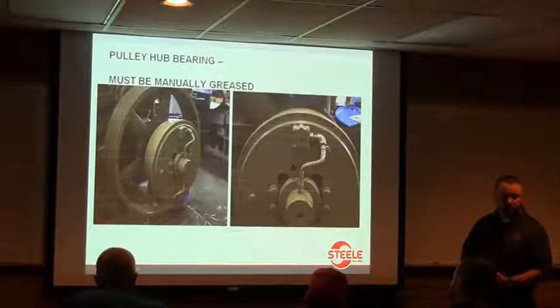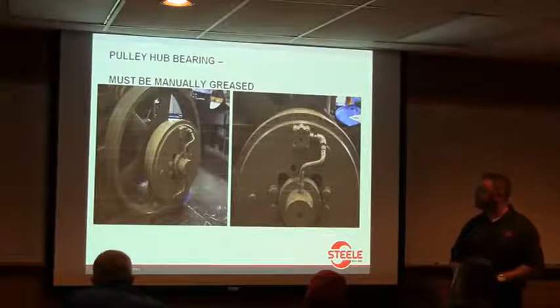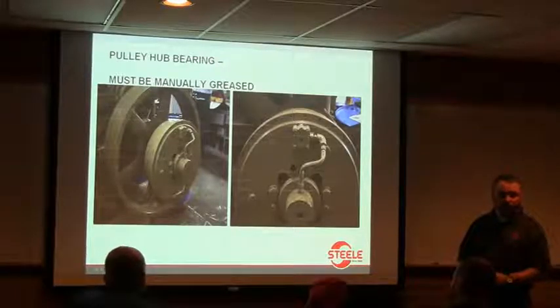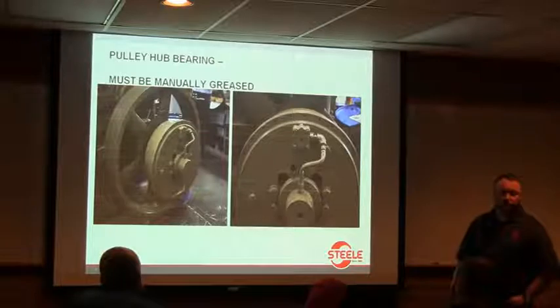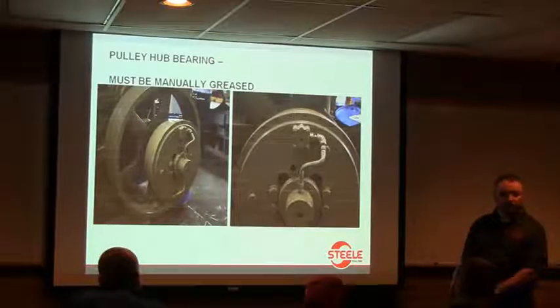to take an air hose. I've got to be careful saying that now with silica. Silica rules and everything else, but what's nice is you can have a little dust and dirt build up on those clutch discs and everything, and typically what you can do is take an air hose and periodically blow those out. I know we wound up one day having a clutch smoking after lunch, and you get pretty nervous in a hurry when that happens. We went up and blew it out real good and went on and took care of it.